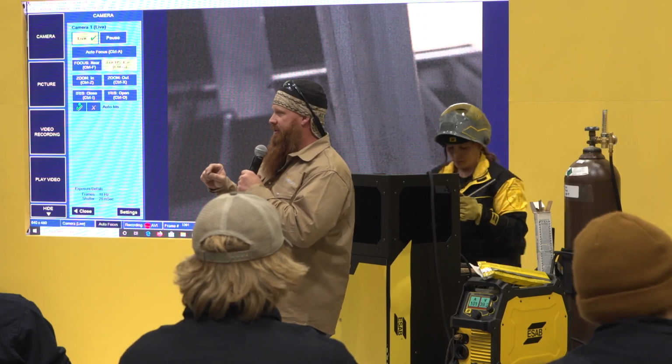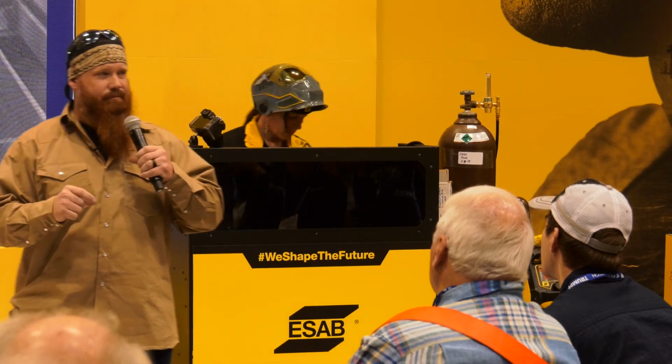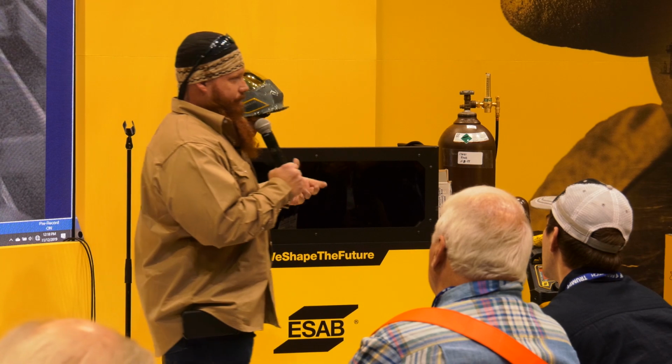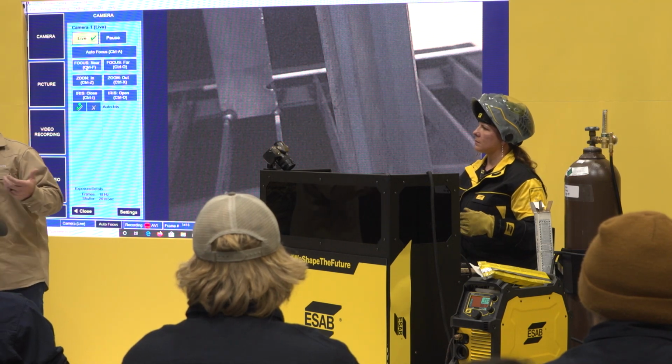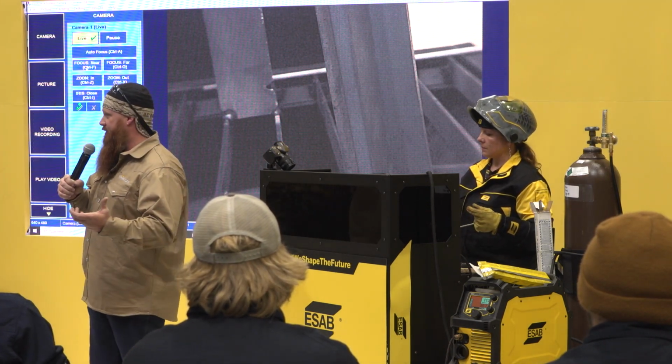Your welding rod diameter is going to be based off the thickness of the material. So anything I would say 3/8 or larger, I'm going to jump right up into an 1/8 inch electrode. Now if I'm not running beveled plate and I have something bigger, I'm going to go to a 5/32 electrode. Well, guess what? Same principle is going to apply. How do I run that in the flat position?